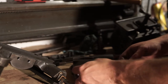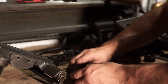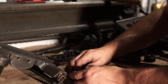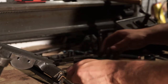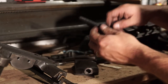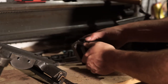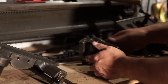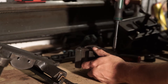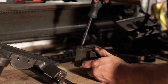Just back this out. Once you have this all the way out, you just unscrew from the nut inside — and there it is. The threads on it look good. With this as well, the jibs were tight so I loosened them up — the jib nut and the jib screw adjusters — because you kind of need to in order to get to it.